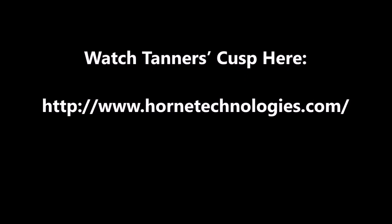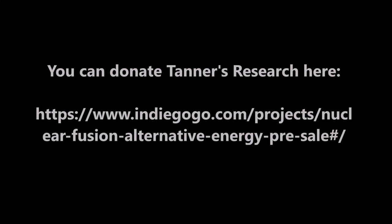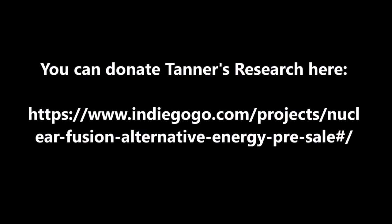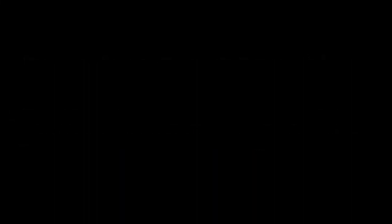We'll do neutron counts — that's basically what we're going for here. Once you get all the system up and running, you want to explore the parameter space. You want to try to map out power in versus fusion rate. So efficiency is really what we're going for. There hasn't been a lot of work into just optimizing the parameter space for this type of device.